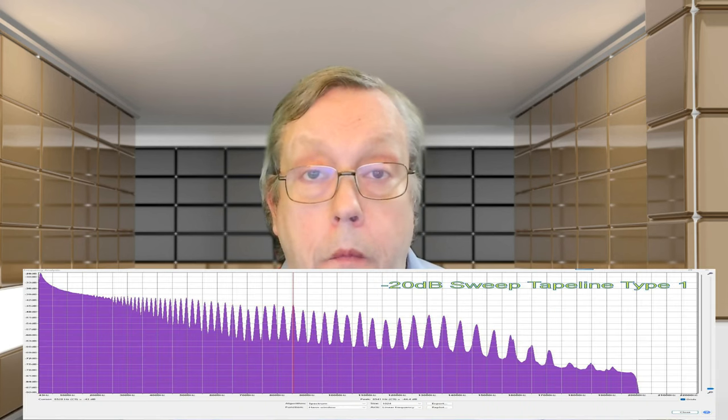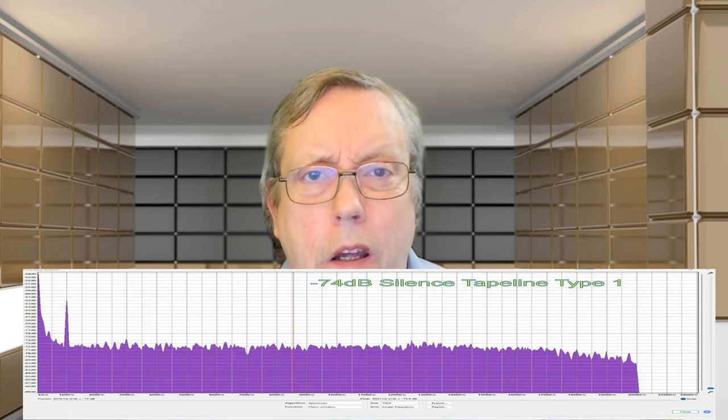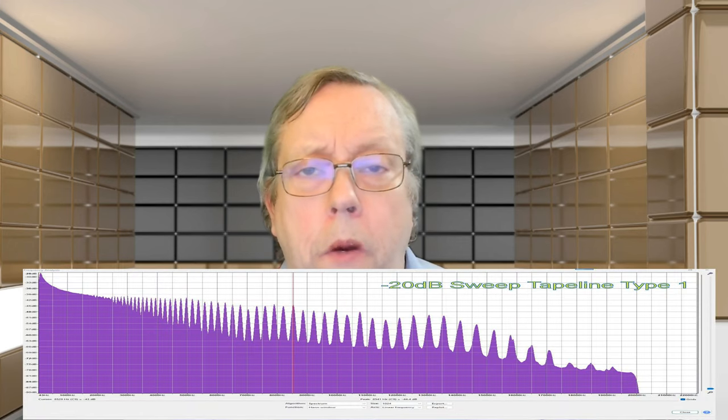What does that actually mean? Well, I'm glad you asked, and I'll try to explain. What does that actually mean, then? Is the tape any good or not? Well, what it actually means is this. Yes, it is a very, very good tape. It's got a wide frequency range for a Type 1. It's got reasonable noise levels for a Type 1. And, well, 17 kHz at minus 20 dB, that is absolutely, put it that way, above average.